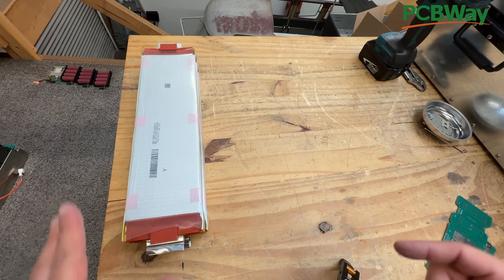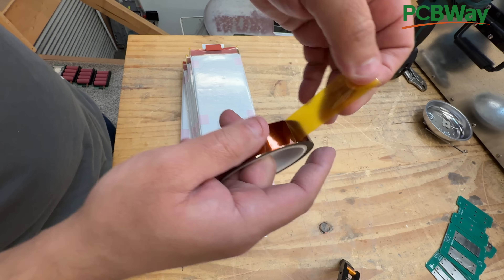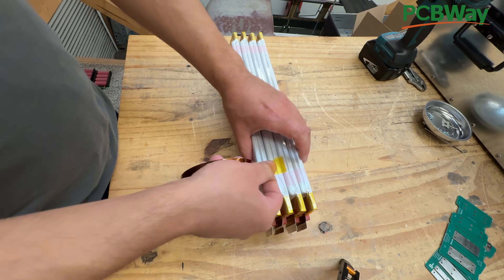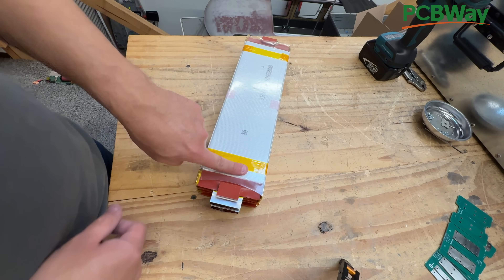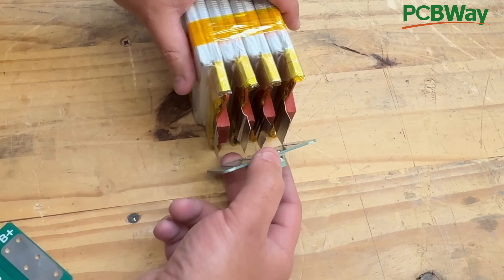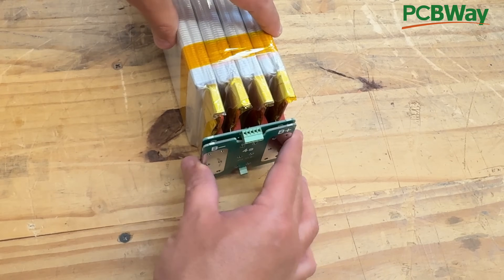Now that you have them lined up, we're going to use Kapton Tape — a really good battery-making material developed by NASA. It's flame retardant, does not melt, and has a really high temperature melting point. A lot of older NASA projects are full of Kapton Tape. Now you get the board with the positive, make sure the little tabs are straight. The bottom board has slits cut through it, so the tabs on the center fold in and the outer ones fold out. Then we top this and use screws for that.